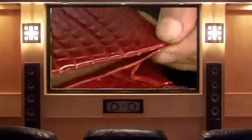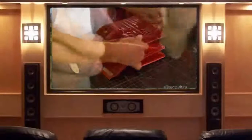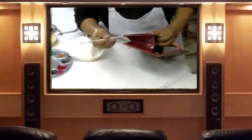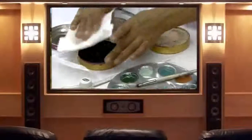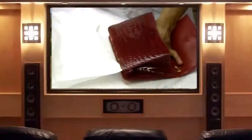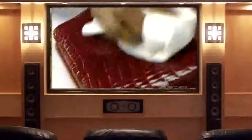He applies the back and front cover to the lining of the bag, making sure all the covers line up perfectly. This step is only performed by experienced pocketbook makers, as it is crucial to the final look — anything less than perfect would look like a cheap imitation. Custom colored paints fill in any gaps and cover any variation in the leather. They finish by polishing the bag using a small amount of shoe polish and a buffing cloth, using very little to avoid buildup in the grain.